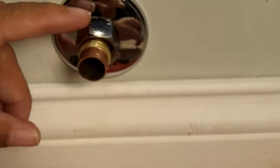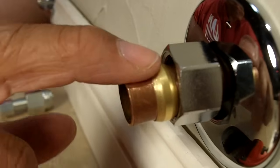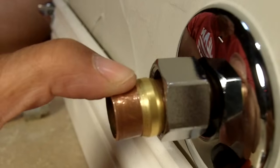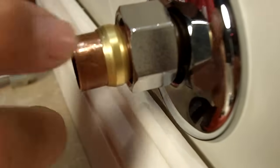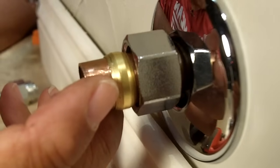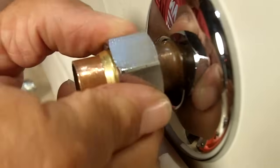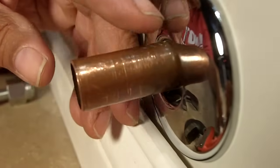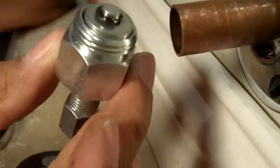So we're going to take that off. Now here's the big difference between the push fit and the compression — it's this ring right here, called a ferrule. This ferrule is responsible for creating the watertight seal. The nut clamps down on that ferrule and creates that seal. When you're taking out an old compression fitting, this ferrule gets stuck and doesn't always come off easy. This one is new so it's going to slide right off, but you may not have that same luck — you may need this tool here, and it's called a ferrule puller.